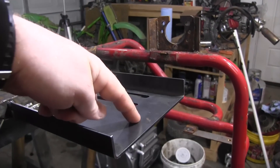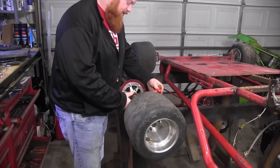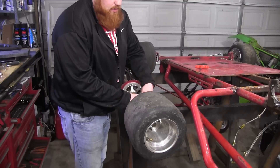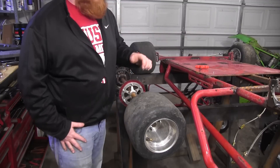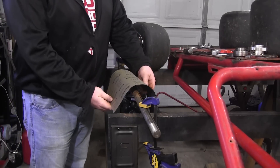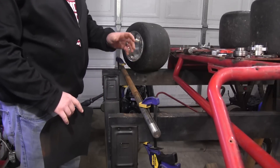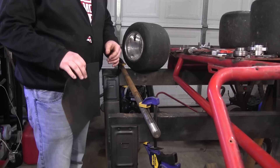I'm going to go ahead and get these last two pieces put in there, and we're also going to start sanding on that old rusty axle. I'm going to pull all the collars off of it and everything just to make sure we get the axle really nicely polished, and then I'm going to rub something down the axle to prevent it from rusting. Everything is seized on this — it really drives me crazy that I left it out there. I've got the axle clamped down to the workbench. I'm going to take some 220 sandpaper, lay it over the axle and pull it back and forth — you can polish an axle in just a few minutes with this method. Once I get everything polished out I'm going to file the axle to make sure there are no burrs that would stop the bearings from sliding on.